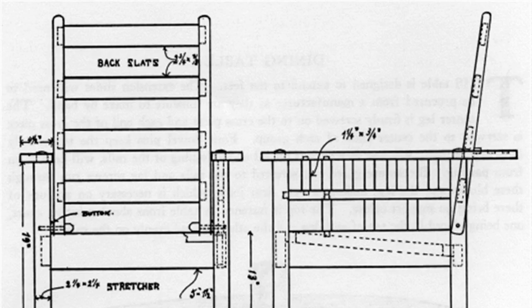Step 1: Make these cuts. From the 2x4s: 4 pieces at 1 and 1/2 inch x 1 and 1/2 inch x 24 and 1/4 inches for legs; 2 pieces at 1 and 1/2 inch x 1 and 1/2 inch x 34 inches for the back; 2 pieces at 22 inches long, no trimming, for inside supports; and 2 pieces at 12 inches long, no trimming, for inside supports.